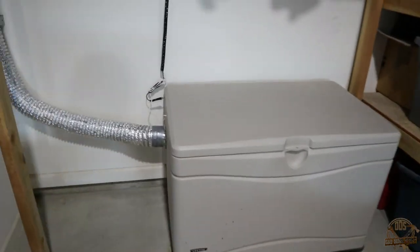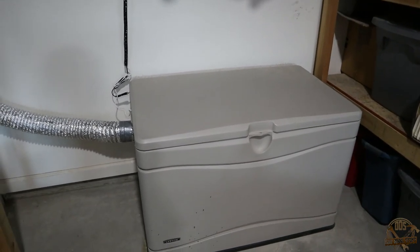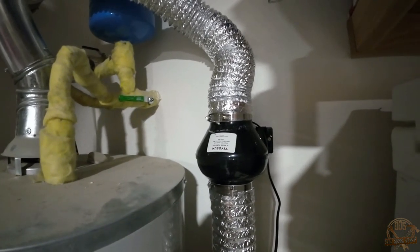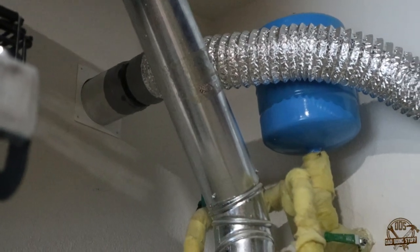Here's what the project looks like pretty much finished. You've got the yard box with two litter boxes in there, the motion sensor that activates the LEDs and the ventilation fan, using a four-inch duct pulling out of that box. I did upgrade these to hose clamps instead of duct tape, and then it ventilates through the damper and out the dryer vent to the exterior wall. That's my project — love it or hate it, put your comments down below. I try to get back to everybody that comments on my channel as best I can. Hopefully you enjoyed this. Please consider subscribing, and as always, thanks so much for watching. Have a great day.